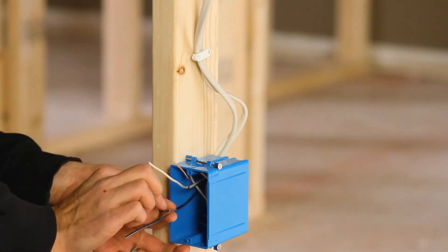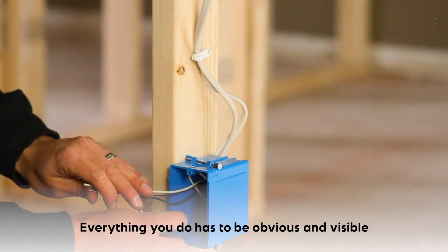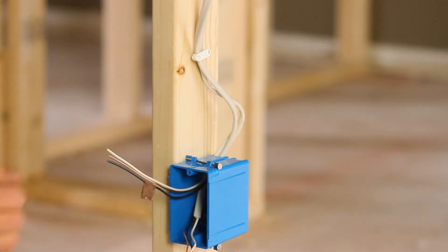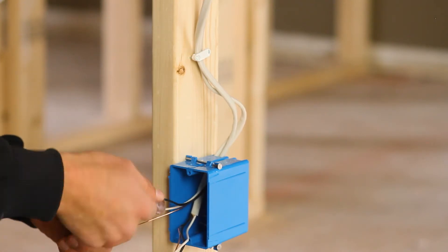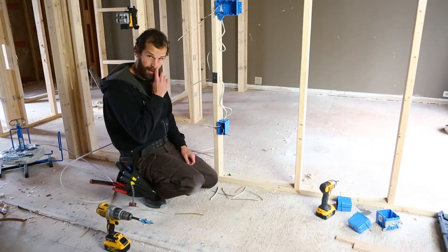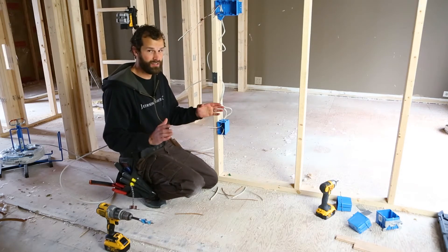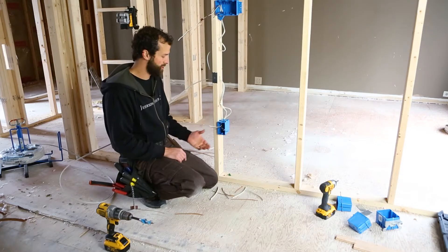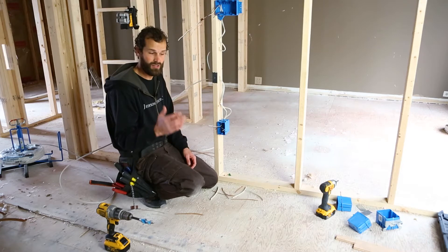I'm gonna put a little flag, real obvious and visible. Everything you do has to be obvious and visible to the extreme, because most painters are gonna spray right over this box. They're gonna disguise the color coding, and I want that flag to be readily evident. I don't want to just wrap it tight on itself. I'm trying to see the endgame from the beginning — I anticipate that before I get back here for finish-out, I will have been to a dozen, two or three dozen different job sites. I can't keep mental track of these wires, so I'm leaving myself all the clues and indicators for a smooth, seamless, successful finish-out.